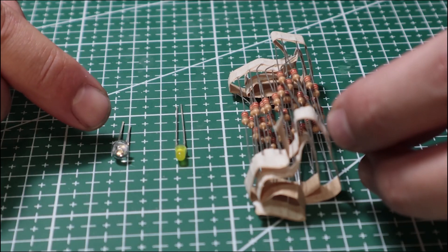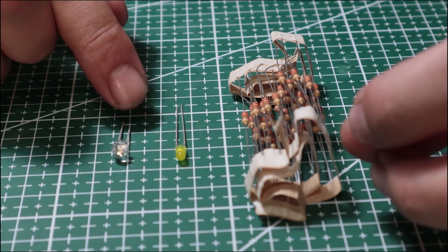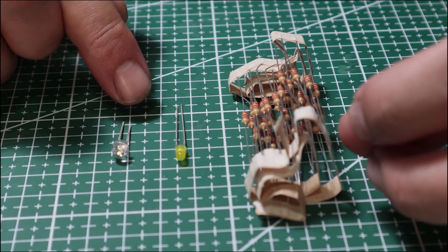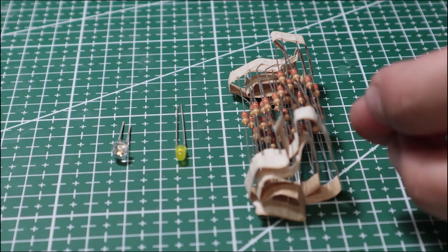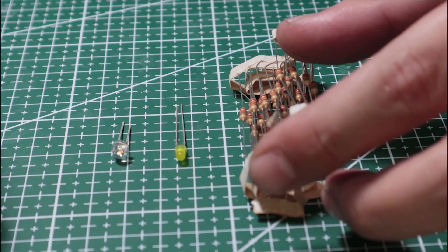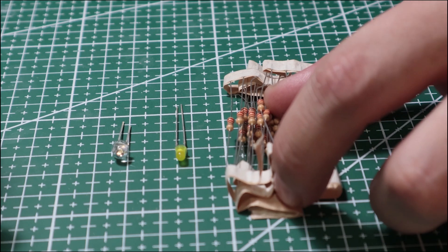Let's talk about the parts I used. I will use LEDs for the lights — yellow 3.5mm LEDs for signals, 5mm LEDs for headlights and others. Since the Arduino provides 5V output, I need to drive the LEDs with resistors. I will use 220 ohm resistors.